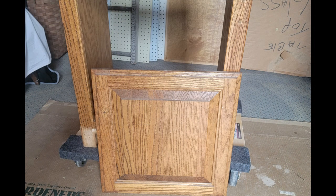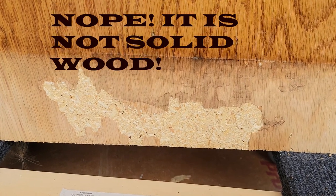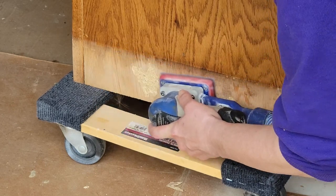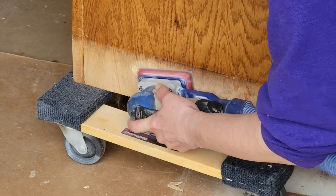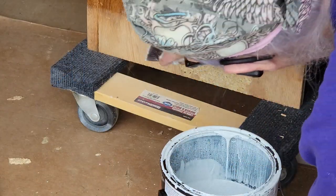Took the door off, and also took the handle off. I had a special handle I was going to put on here. There's that lovely spot. So I went ahead and got the surf prep sander out and 220. I sanded everything down and gave it a scuff sand and got this spot ready so I could put some of my Gorilla Wood product in there.